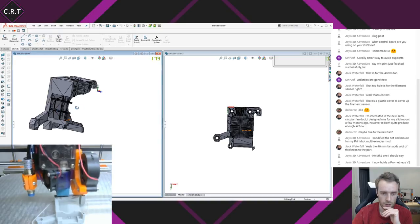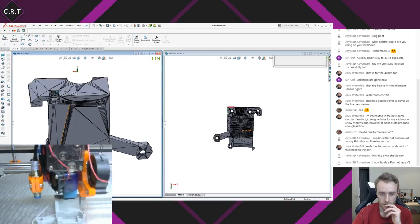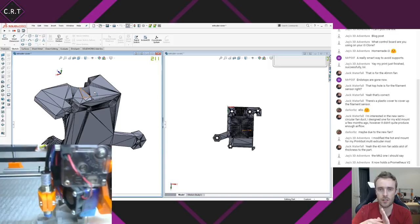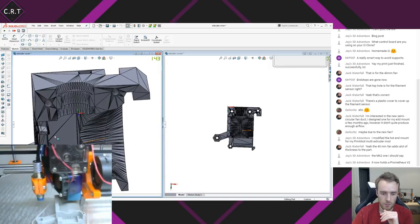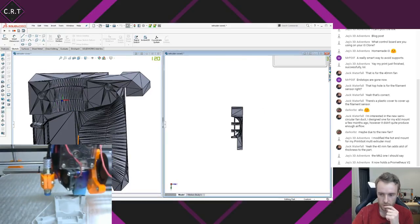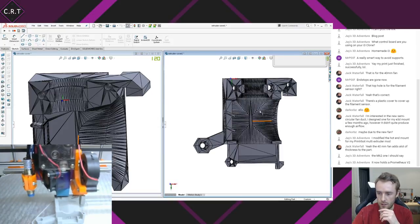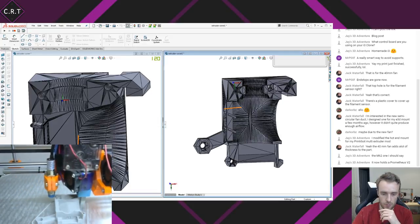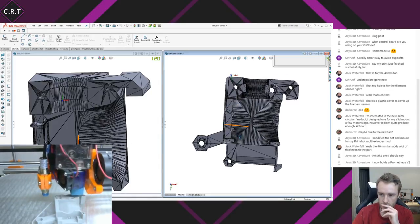And just for the fan duct. Obviously the resulting thickness, this bit's changed too. This is now what holds the extruder up, as opposed to how it did previously. Again, more changed geometry around the ducting, based on the 40mm fan and the slightly improved clamping of the V6 heatsink. Before, it was held all around here and down here. Now it's just held at the top and at the bottom, which is all you need. Two points locks it in place. I think that's pretty good.